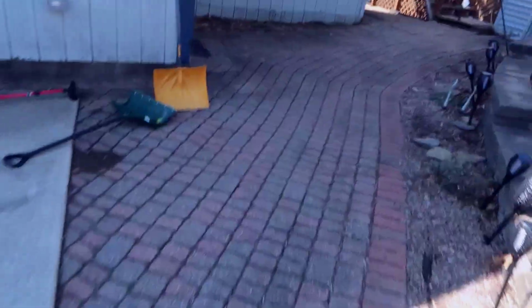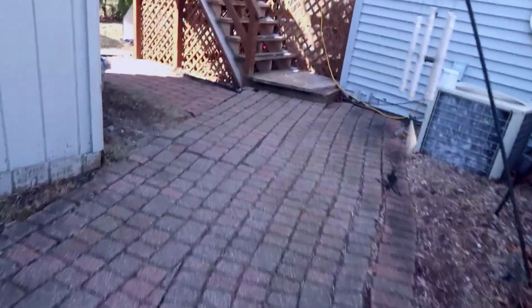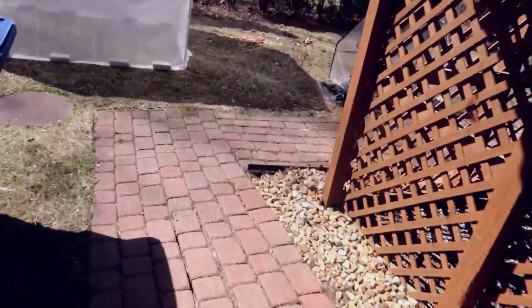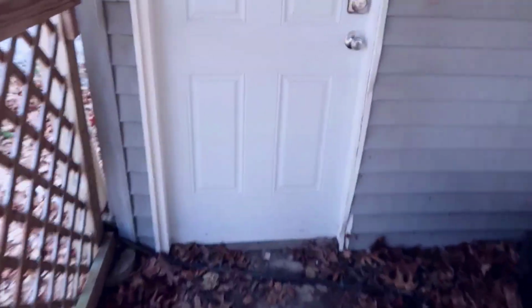In fact, we actually have two 200 amp breakers, because I've got another one here in our garage, and both of them are all connected off the main panel. And I was able to run a portable generator that is supported, I believe this one is roughly up to about 13,000 watts. And that transfer switch really worked perfectly to do this.